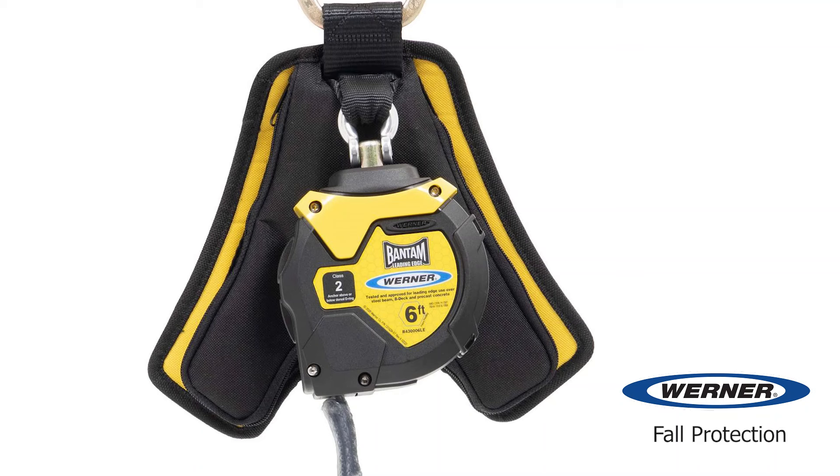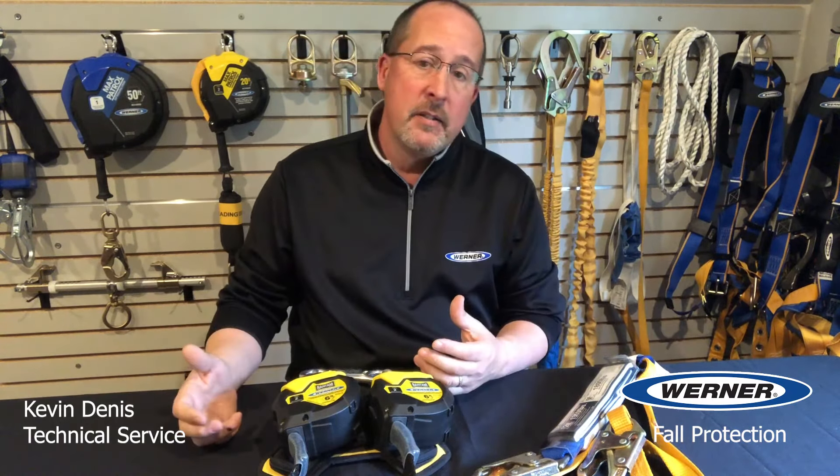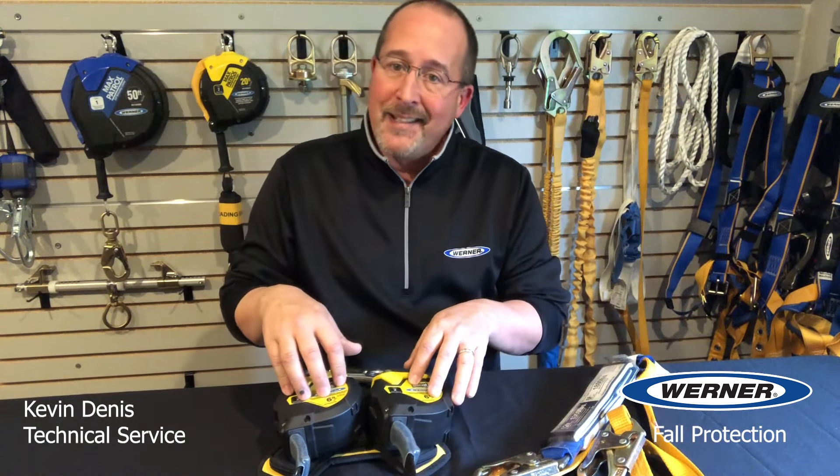Even though the guardrail isn't sharp, any interruption of the line between the anchor and the person will affect the forces on the person. All Class 2 SRLs have an energy absorber on the harness end that will control forces on the occupant. Given the line contact, the potential increase in fall distances, the anchorage below the D-ring, and the scenario of the line going into a door hinge, control panel guards, or whatever else it might contact, Class 2 SRLs have a higher tolerance for free fall distances and are preferred when the line comes in contact with something. The R4300006 LE, in both single and twin leg options, are popular players for team SRL, with a small snap hook on the anchorage connection and 6 feet of working length. Alternatively, the R4300008 LE in cable is another popular model.